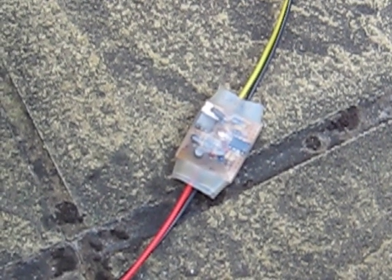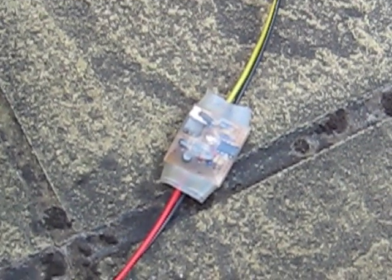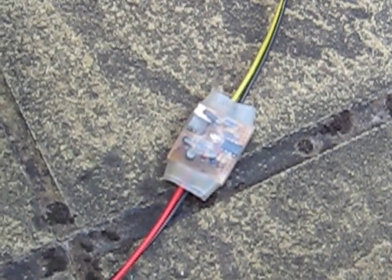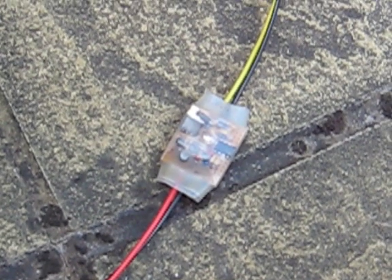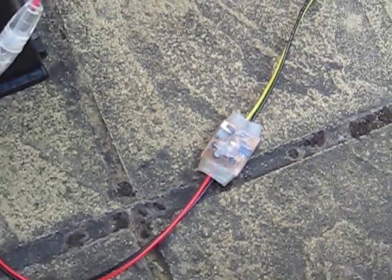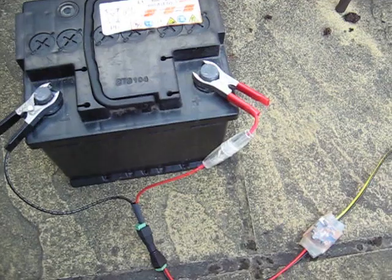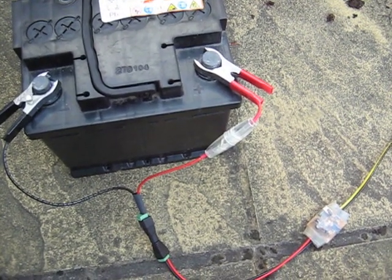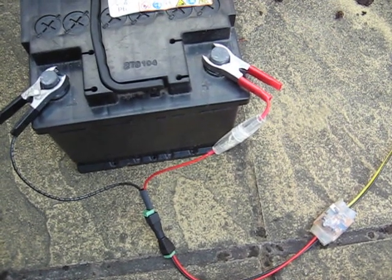And that protects the battery. The charge controller also has a two stage charging sequence. The higher voltage initially gets the battery up to full charge as quickly as possible. And then it gradually reduces down to a lower voltage, which is 13.5 volts. The battery is then on float charge, and it can be left at that voltage indefinitely. And that keeps it topped up.